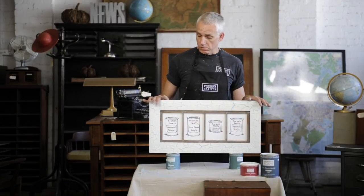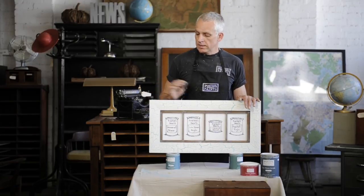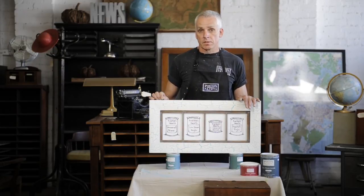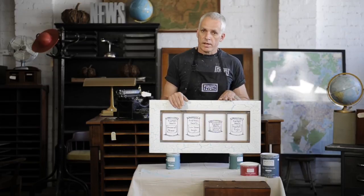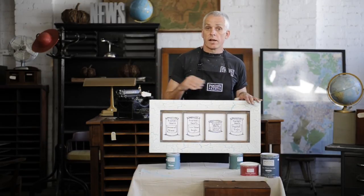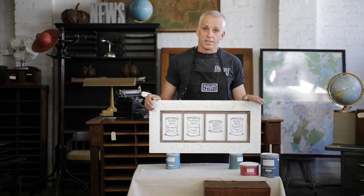Crackle, everyone — how good does that look? I've just got an old frame that I had lying around at home. I've given it a sand just to give it a bit of a key, dusted it down, put on some universal primer, two coats of the low-sheen acrylic tinted to this beautiful blue color Amulet. I've let that dry completely, then I've criss-crossed on my crackle medium — criss-crossing is really important because it gives it all the textures for when the top coat cracks and makes all those cracks go in different directions. I've left that for 12 hours, then put on my eggshell acrylic tinted to Milk, a really soft organic off-white. As I brushed it on in one direction, it started to crack almost immediately. You don't need to topcoat after that, you don't need to seal it. It looks good just like this — it's perfect, easy to use, looks fantastic. Have a lot of fun with it. I'll see you next time. Bye.